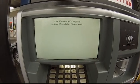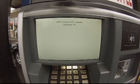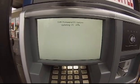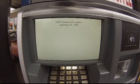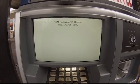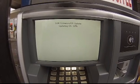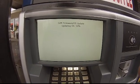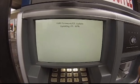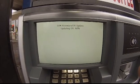Okay, so it completed the file transfer and upgraded the OS for both the SPM and the SVM. Now it's going to update the iX OS, at which point it should go through a reboot, and we'll load our config so we get the correct touchscreen and the right soft keys, and we'll also capture logs at that point. The whole upgrade process takes about 20 minutes from start to finish — a little bit longer than a standard cat board, but it's doing a lot more stuff.